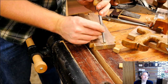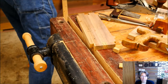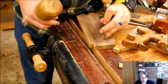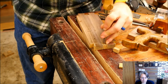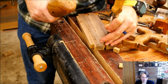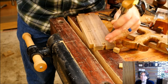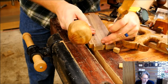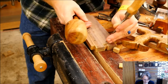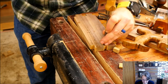I can grab my chisel and grab my smaller one. Nah, it's not. Let's grab this one. And a mallet. Oh, down on the floor over here. And because we're going with the grain, I can set this in here and go tap, and these blocks just pop out. No worry about peeling in, no worrying about cleaning out. And so I take it back close to the line, not into the line yet. And now I'm going to go right into that line. Tap it straight down.